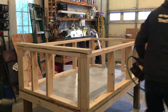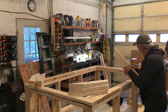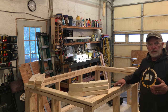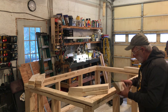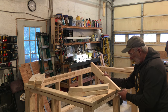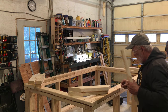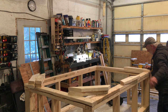I haven't cut the rest yet, but everything is marked. This is where the roof starts to take shape — pretty cool. I want to do some painting before I put the sheathing on. We'll have half-inch sheathing and then a two-by-four sub fascia. I've put a mark on every one of these at two inches — allowing half an inch for sheathing and an inch and a half for the two-by sub fascia. Let's nail these on.